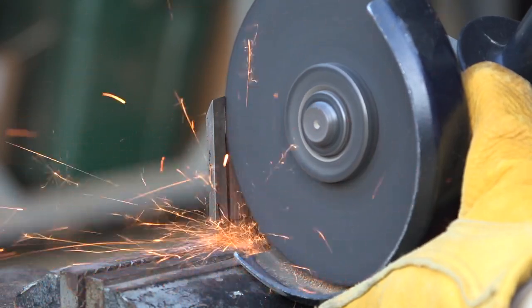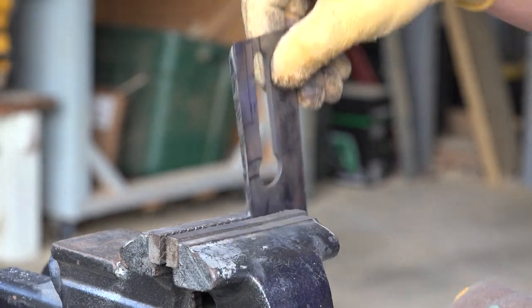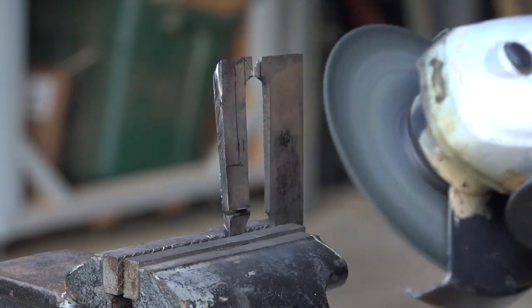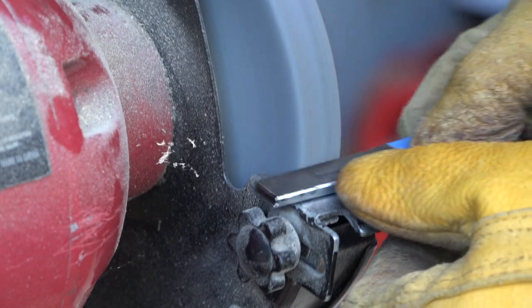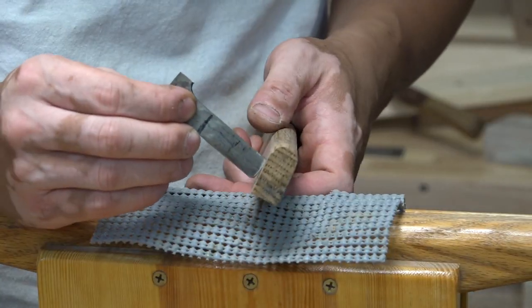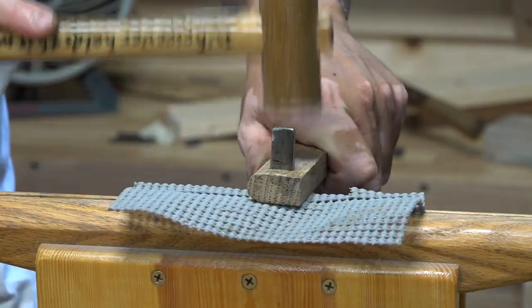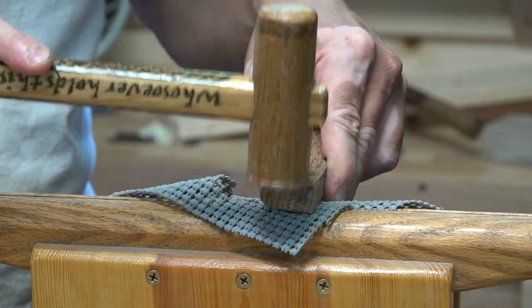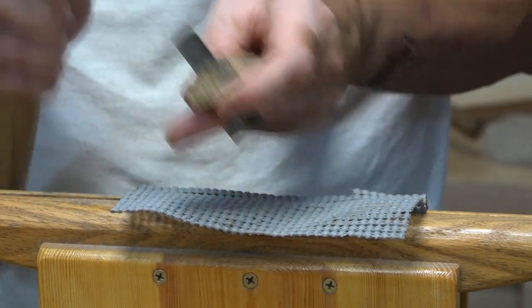I'm making the cutting blade from an old laminate steel plane iron, cutting it as frugally as I could — the long piece I'm saving for another project. Generally I like to do all the roughing out with power tools and save the hand tools for fine and detailed work. I tapered the blade slightly so it can be inserted just one way from the underside of the stem, which seems like a good idea given how force will be applied.